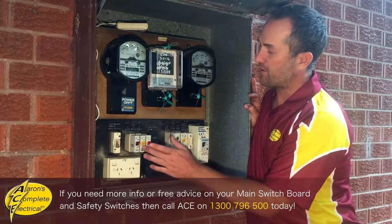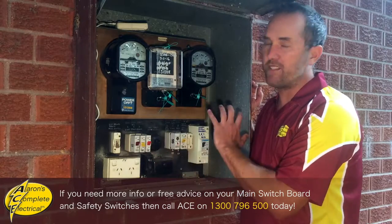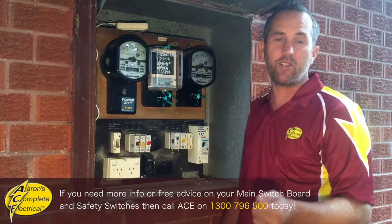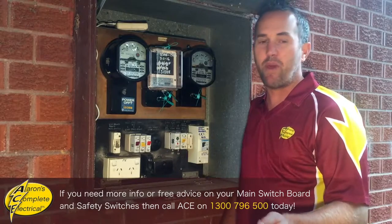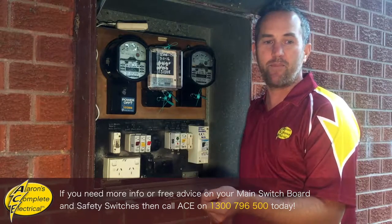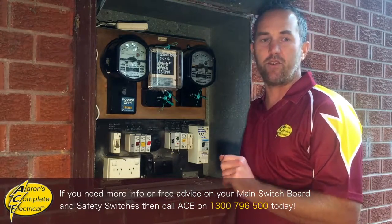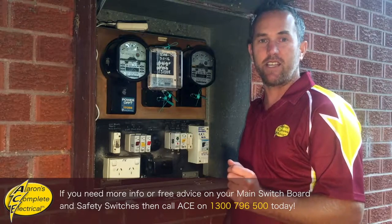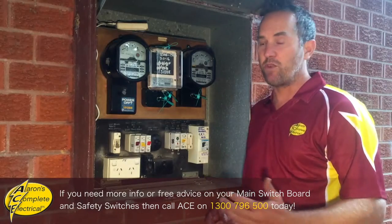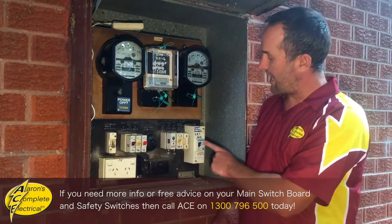For the example we're doing today, circuit 2 is the one that's causing it. We leave that circuit off and go inside to have a look at what is being controlled by circuit number 2. You get a lamp and use that to test the power points — any power point that the lamp doesn't work on, you know that's on circuit number 2. We go around with our lamp, and if it's on circuit number 2, we unplug all of the other appliances. It's important that you unplug them and not just turn them off, because this actually isolates them from the safety switch. Now we've got all of our appliances on circuit number 2 unplugged, and we turn on circuit number 2 — and the safety switch has stayed on.